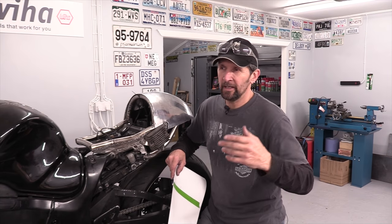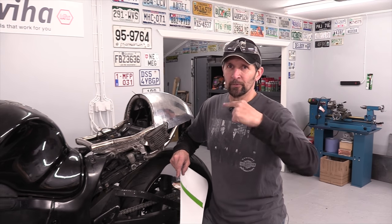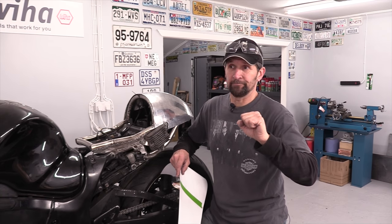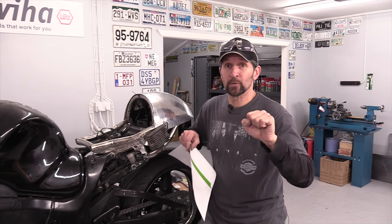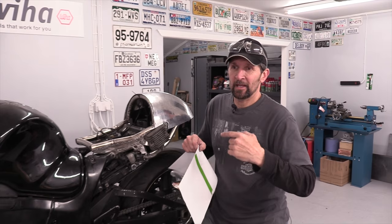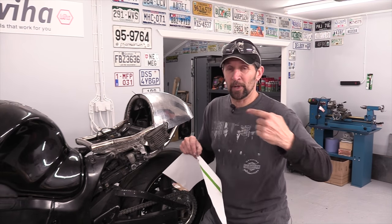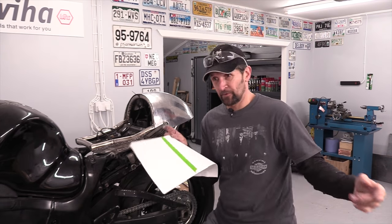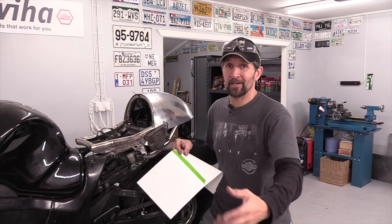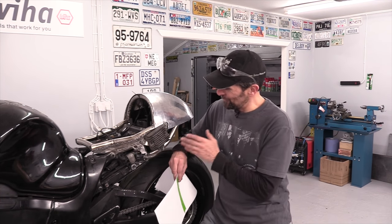I'm sure if you've ever done relocation of a wiring harness in the past, you know yourself, it's quite easy to do because the strapping that goes round the wiring harness acts like a plaster cast, and it holds it in shape. And if you try and bend it to go in a different direction, actually you can fracture the wiring inside because it's being held so tight by the binding. But if you unbind it, it all becomes floppy and loose like a jellyfish, and you can move it anywhere and rebind it. Now, I've done that, had a little reroute, got rid of that.